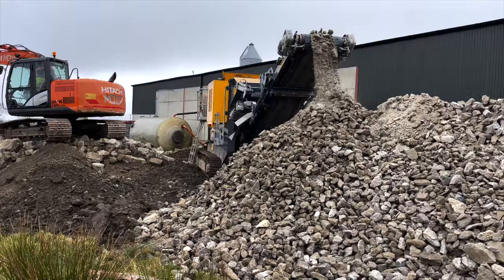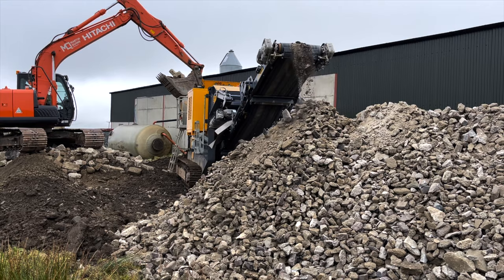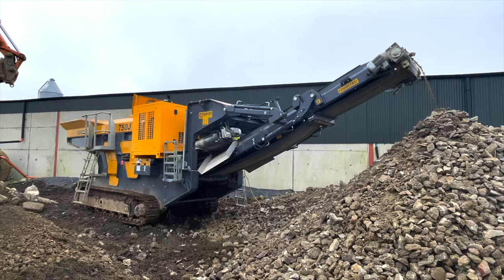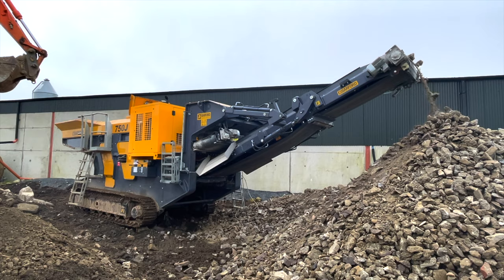This machine is great for crushing concrete, which you can see here in this video, but it's also ideal for processing materials like asphalt, demolition materials and recycling waste. If you are crushing something like construction waste that might have metal or rebar in it, there's an overband magnet above the main exit conveyor, so you aren't going to damage a screener or an impact crusher that might be working after this machine by throwing a chunk of metal at it.